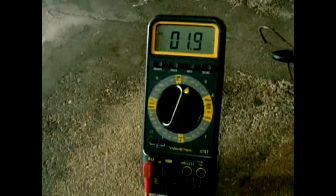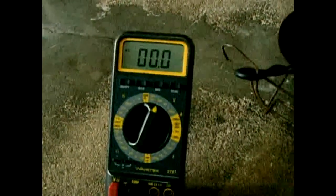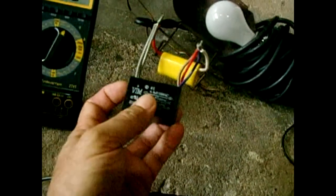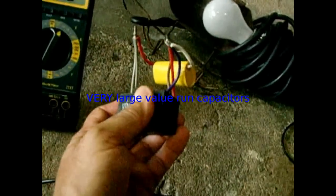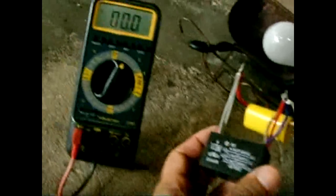Now with a 75 watt bulb — 75 watts is about the limit for this inverter. The output voltage drops to around 97-98 volts. When I used my induction generator, I found that adding a capacitor in series with the output lowers the frequency and causes a power increase. The 97 volts you see now will come up to around 120 once I connect this 12 microfarad capacitor.